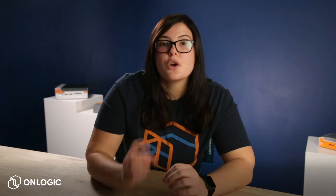And finally, let's quickly talk antennas. One of the most important antenna specs to consider is the antenna gain. Gain refers to how well the antenna amplifies the signal it's receiving. This is measured in decibels — the higher the decibels, the better the antenna will perform in strengthening weak signals. The typical range for screw-on antennas is 2 to 7 decibels. Different antennas are tuned to amplify different signal bands. Like many WiFi networks, Bluetooth operates in the 2.4GHz band. When buying an antenna, you need to ensure the bands you'll need are covered.